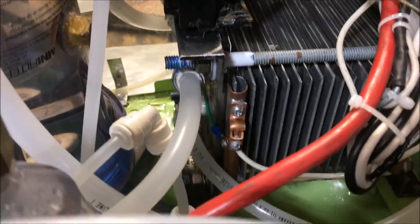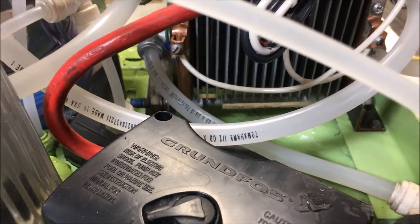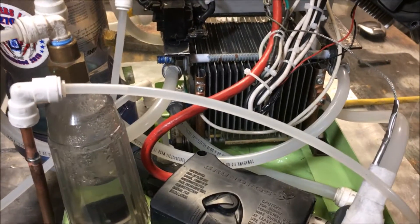I'm probably going to go ahead and give them a full turn, maybe more. I might even bring it down to two millimeters, but the problem is we need to inspect the leak because if a bunch of electrolyte leaked out into that plexiglass plate under the cell — that plate is holding those electrolyzer plates in place so they're not just bearing load by compression. If a massive leak got up under there and I now have electrical contact between the plates, that could interfere with performance. It wouldn't inhibit the cell from operating, but it could definitely cause problems. A thin membrane of electrolyte that small can only propagate at maximum 30 watts of electricity.